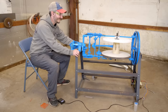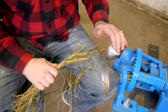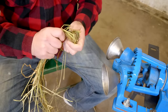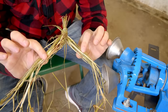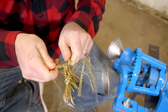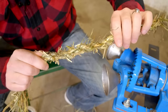It works. It's actually a lot quieter than I anticipated. At this point I can give a brief demonstration of how this machine is meant to work. It has two cones that both rotate in the same direction. Starting with a handful of natural fibers, if I were to turn this into rope by hand, I would tie a knot in one end and then divide the bundle into two sections. A two-stranded rope is formed by turning each of these sections in the same direction — my right hand clockwise and my left hand also clockwise. As I continue to twist both sections, the grass automatically wraps around itself in a double helix, forming rope. This machine with its two rotating cones is meant to work in exactly the same way. The rest of the machine is really just there to pull the rope as it forms and bundle it on the spool.